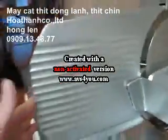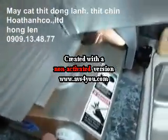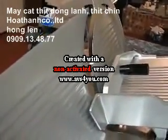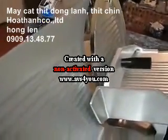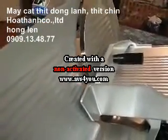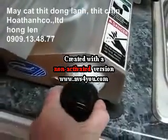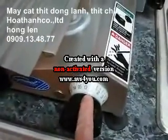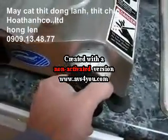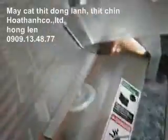If you come around, this piece is called a regulator plate. It's adjusted simply by turning a knob. See the gap opening up? I mean, it's not real difficult stuff, but it opens up and exposes the blade. Closes back up. You have little indexing numbers that you can turn to. If you're running a deli or something, you slice it to a particular size, such as a half or something like that. That is really, really thin.